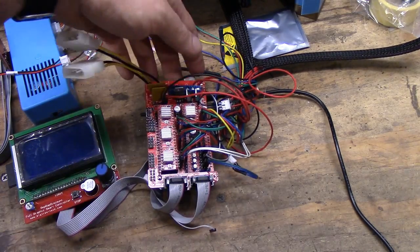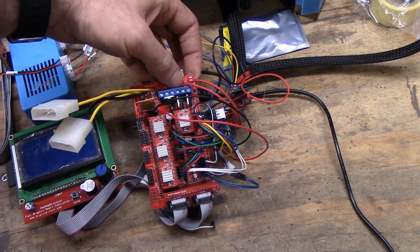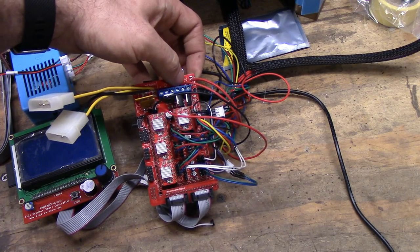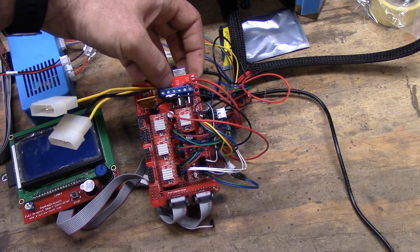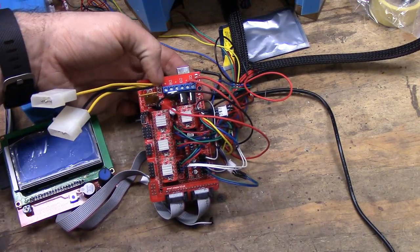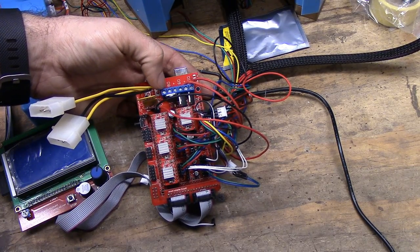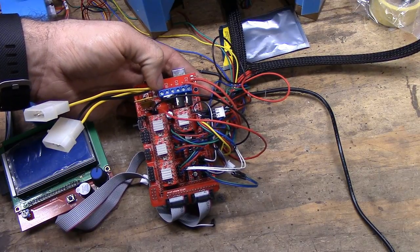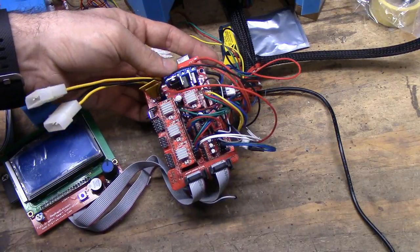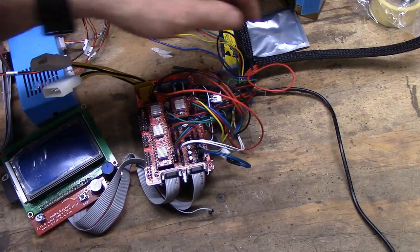That is all the wiring. I just want to throw out here, this can be either thermistor, hot end, or hot bed, or cooling fan, or some combination thereof. It's all in the firmware that will adjust that. If you have a part cooling fan, you'll probably want to hook it into this, and you have variable speed and the ability for the ramps to control it on and off. I believe I've hit all the wiring for this.